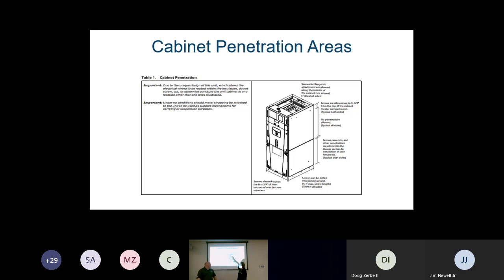Either on the side of the unit or on the top, and you would take your uni bit and then just drill the particular size hole, whether it's a 1/2 inch Romex connector or a seal tight connector, 3/4, whatever you desire, you want. You can get a nice cleaner, better application for that.